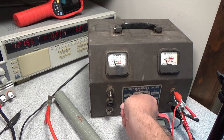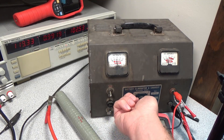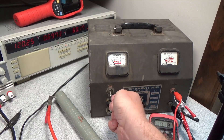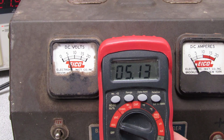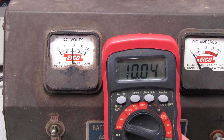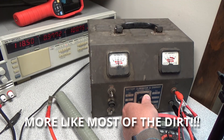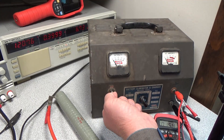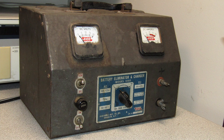Turning it on and cranking up the voltage — look at that, it looks like it's working great. I'm getting both current and voltage readings. It looks like both the 6-volt and 12-volt paths are working. The 12-volt path does have significantly less current available, as you can see on the meter with a one-ohm load connected — I'm suspicious the smaller rectifier diodes are not functioning up to par. Five volts on the meter matches up, 10 volts matches up, 15 volts is looking good as well. I'd say this is a success. I am leaving some of the patina on this meter and I'll probably replace those diodes in the near future. Thanks for watching — keep YouTube alive by pushing the like and subscribe buttons. I kept the old look and brought it back to functional.